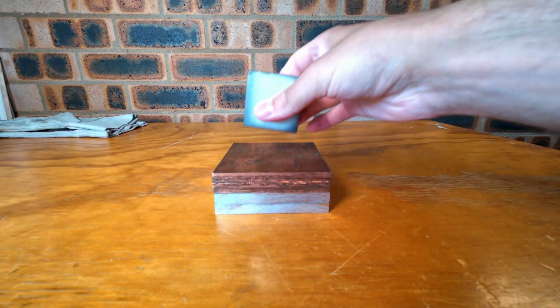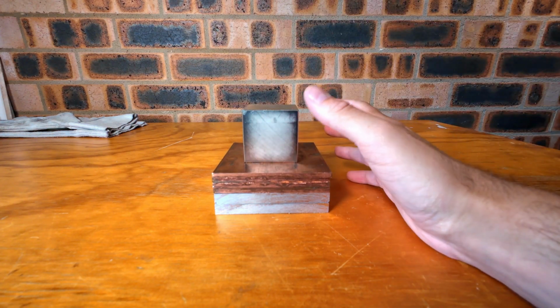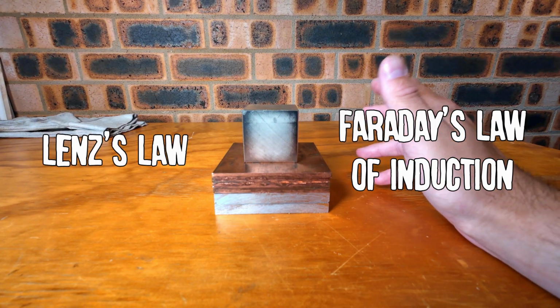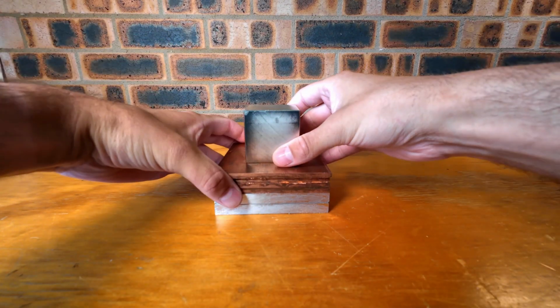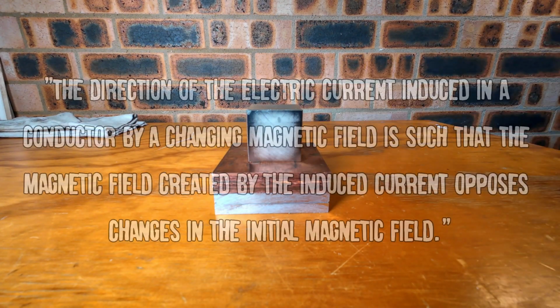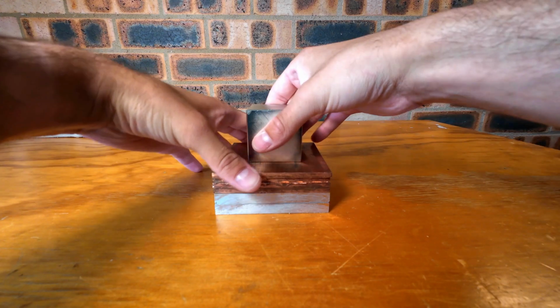So pretty much there are two scientific principles that can describe what's going on here. The first is Lenz's law and the second is Faraday's law of induction. I'll mainly cover Lenz's law for this video, as the next magnet video will be all about Faraday's law of induction. So Lenz's law states that the direction of the electric current induced in a conductor by a changing magnetic field is such that the magnetic field created by the induced current opposes changes in the initial magnetic field.